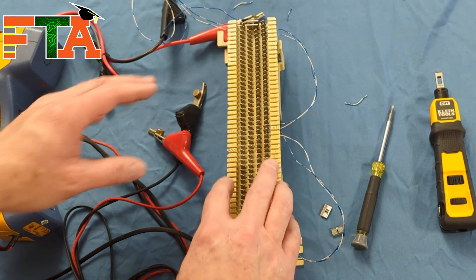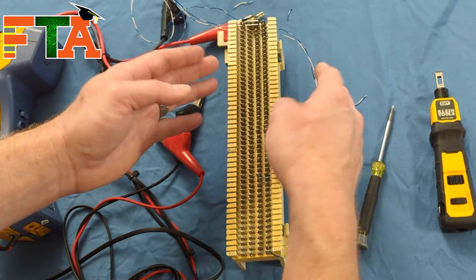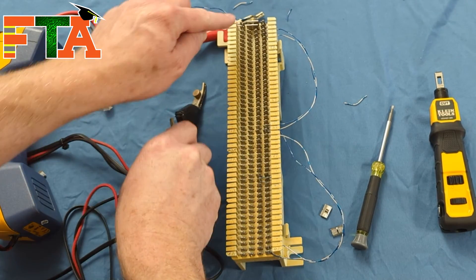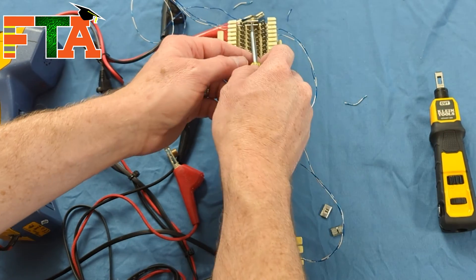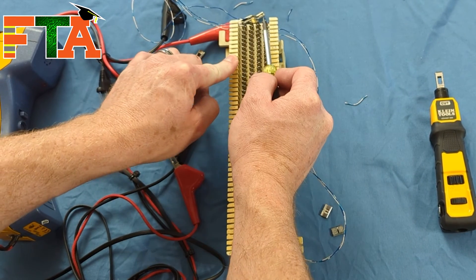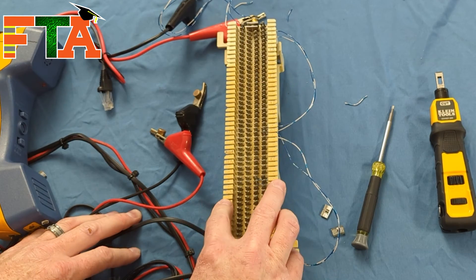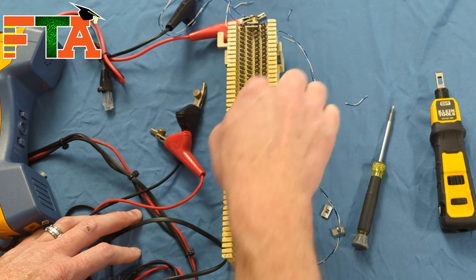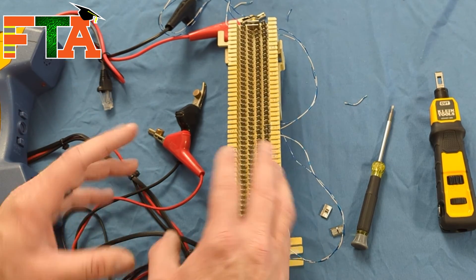Your goal is always to identify where the telco is coming from and where the internal wiring is going. If you come in and everything is already wired up, you'll get dial tone on both the left and right side. To determine which side is actually the telco, remove the bridge clips and test for dial tone — whichever side has dial tone is the telco side. POTS is simple: it's just a dial tone, one phone number, typically on one set of pins, maybe daisy-chained a little. Digital phone systems add other complications not covered in this video.